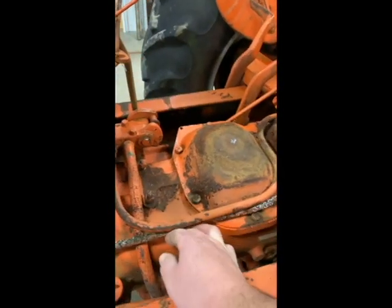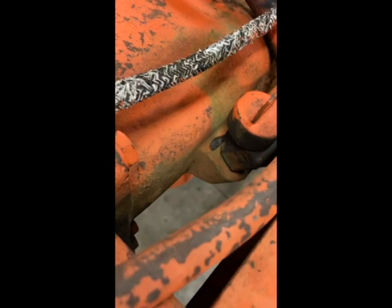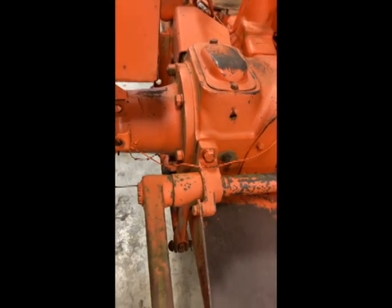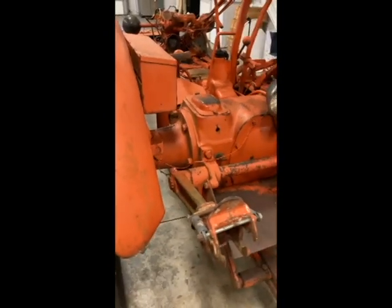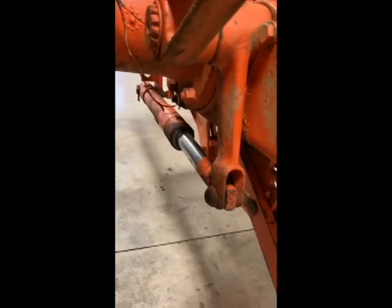When I looked inside the hydraulic reservoir, right down in the bottom there is a ton of buildup - I don't think it's stuck in the neck, just the way everything angles, I think it's kind of thick. The rams are extended out, so I took my floor jack and put a little pressure up because they won't go down - got them broken free. I released the pressure at the pump, which should allow me to push it down and dump any remaining flow through the pump into the reservoir and drain out. However, I couldn't get the rams to go down. They're clean so they should slide in with no problem.